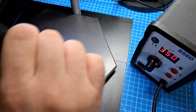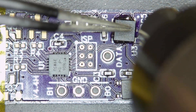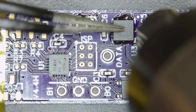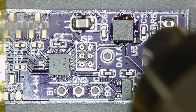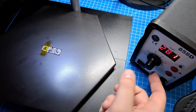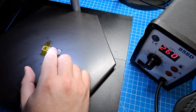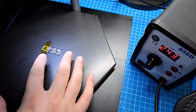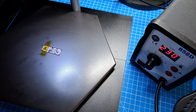It lost its temperature when I went to grab the tweezers. There we go — you see it jiggling. So the nozzle's back in the cradle, fan speed went up to 9 so that way this will cool quickly. You saw that voltage regulator jiggle and then settle back into place when I tapped it from above — that lets me know that it has seated itself and is all lined up. You can see the excess solder squirted out around the sides. We'll clean that up just like we cleaned up the microcontroller and we should be good to go.